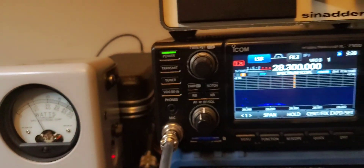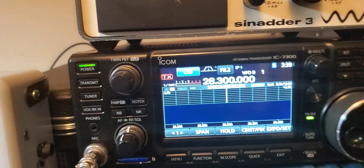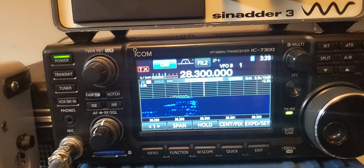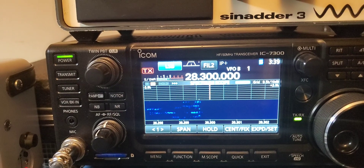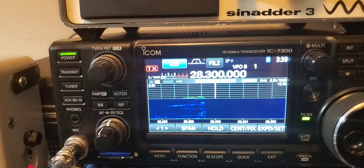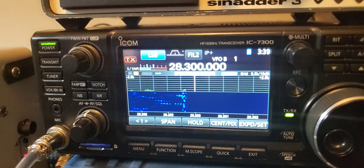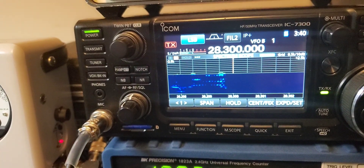I had the filter a little too wide, because on AM when I listen to guys I like a little wider filter, and on sideband I like a little more of a narrow filter. That's one of the advantages of running a radio like this — you can adjust the filter a little bit for your receiver.